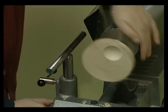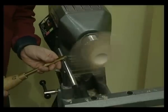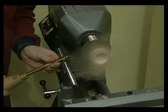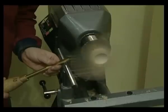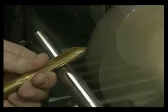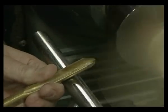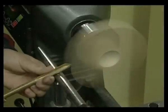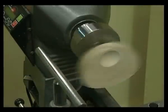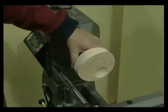Check the tool rest is in the safe tool rest position. Using the 3/8ths or 10mm bowl gouge, approach the rotating wood very slowly. Take very small cuts to begin with. As experience and confidence are gained, the lathe speed and size of cut can be increased. Regularly switch off the lathe to check for a clean cut and how much more needs to be removed until the arc is reached. Once the outside is turned down to the mark, switch off the lathe and check there is a clean finish from the tool. Then sand and finish this side by hand.